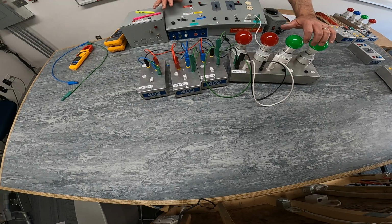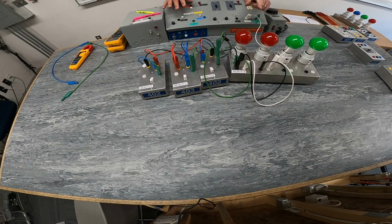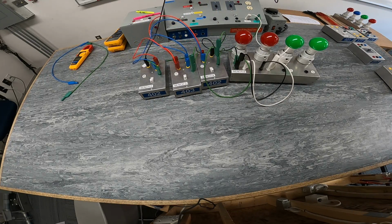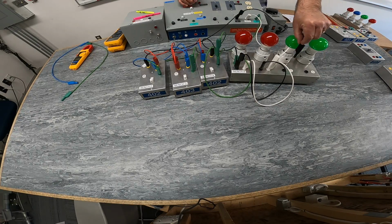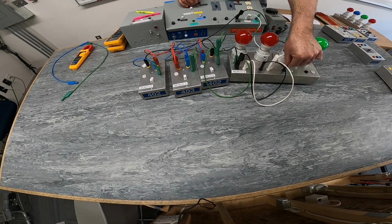But now I want to be able to keep these 2 lights on all the time, energized, while these 2 are being switched. Okay. So in order to do that, I forgot to connect my initial common 3-way back to my power supply. From my power supply, and this will be on your schematic, on your left-hand side will be your power supply, connecting onto the black terminal here.